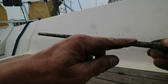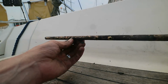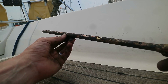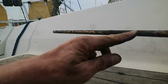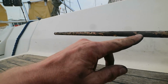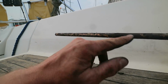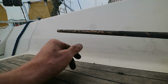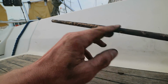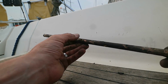I can see straight away that there are 1, 2, 3, 4, 5, 6 holes which point downwards in the engine. They are partially blocked, but not too bad. But the other 3, these are the 3 which face inboard. I believe that these would run in the direction of the injector sleeve, so these probably squirt nice cooling water onto the injector sleeve area. Anyway, they are not holes at the moment because they're blocked. So 1, 2, 3, all blocked with kind of deposits.